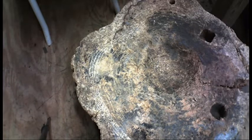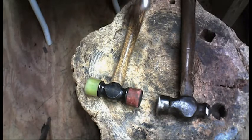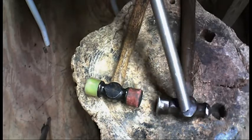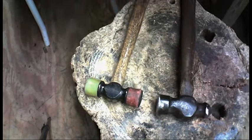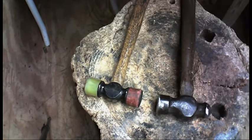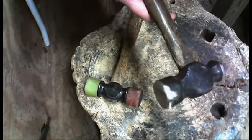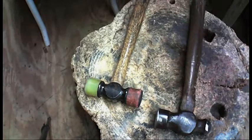We've got our dishing surface covered. Now I'm going to go over the two hammers that in my opinion make the most difference for the beginner smith. You don't necessarily need this hammer as much as you need this one. This is a ball-peen hammer - it's called that because it has a ball end and a peening end. Peening is an old word - when you peen metal together, you're folding it or smashing down rivets so it holds the metal together. The ball end is where you'll be doing your dishing.